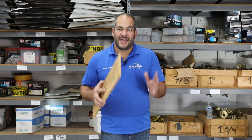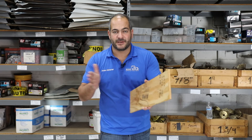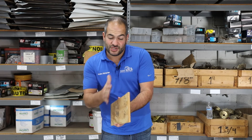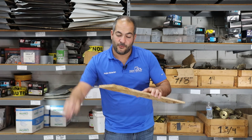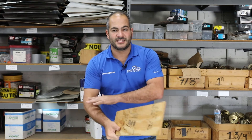Another item we were not able to test is delamination. On a roof that's maybe 40 or 50 years old, we find heavy delamination where the sheets of plywood are coming apart. This happens more often on plywood than OSB because if one sheet starts failing, that entire sheet can start opening up. With OSB, if one small chip fails, your failure is limited to just one location because you have so many strands of wood coming together — one part failing doesn't mean the entire sheet fails. Plywood, on the other hand, fails as a sheet.